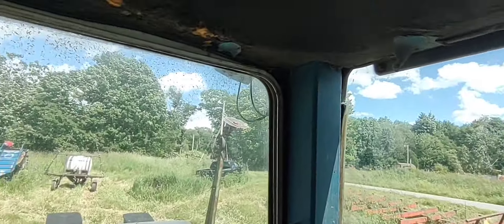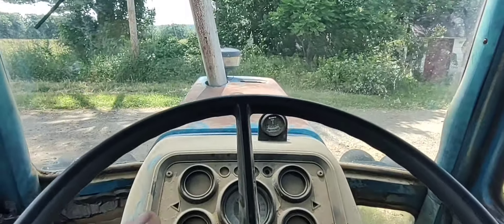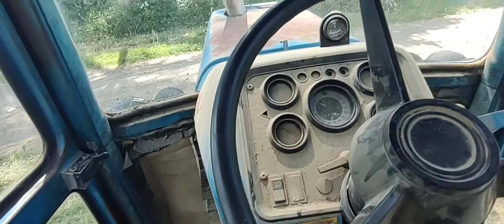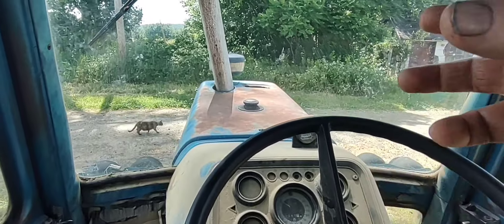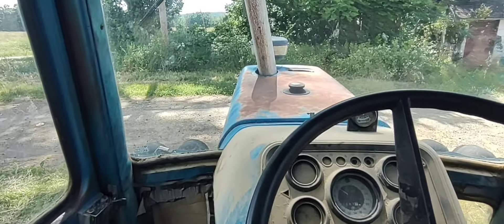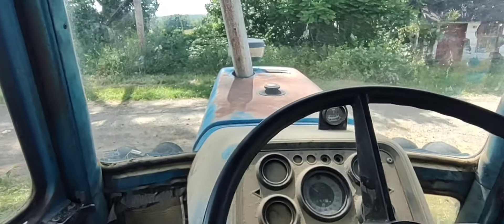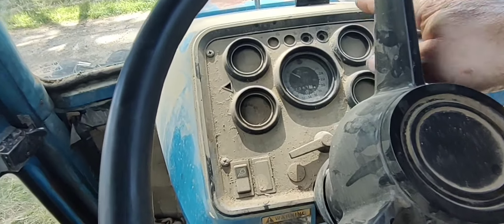When I'm pulling the hill above our house with a load of manure, I can't quite pull that hill, so I'll pop this and drop it into low. When I get up and around the corner, I'll clutch it, hit that button again, and ease the clutch out — just like shifting a regular manual transmission. Because if you do it in eighth gear at road speed, there's going to be backlash and you could shear bolts or cause more wear. So I just don't do it that way. If I'm going to engage at speed, I might idle it down to 1,200 or 1,400 RPMs first to keep engagement as easy as possible.